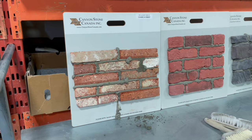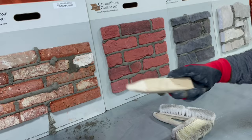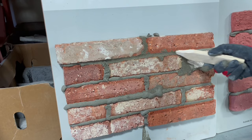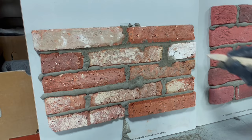We've gone through the different stages of grout drying - this is the sample we can start actually cleaning. You can use just your finger with a glove on, or a little stick shaped to the profile of the grout joint. You can buy grout tools but honestly don't waste your money. Once it's the right consistency where you can't push your finger deeper and it's flaking off, just go along the lines and push the grout in, smoothing it out. Don't worry about little mistakes - once it's dry enough you'll be able to flake them off and brush them clean.